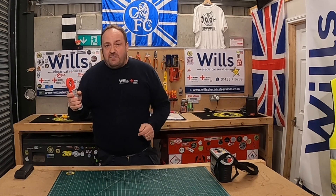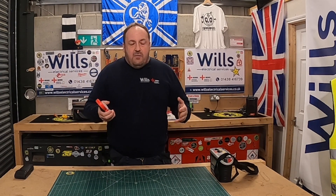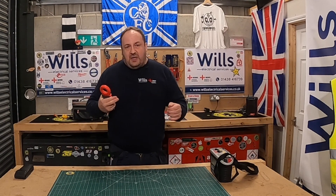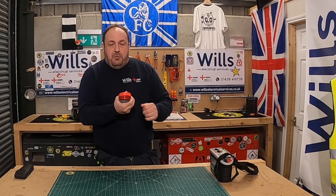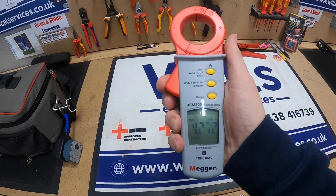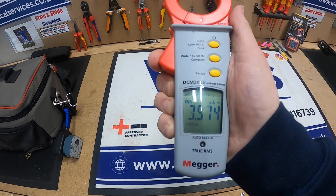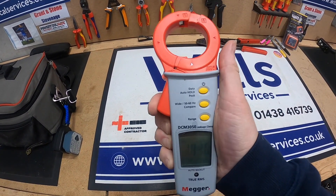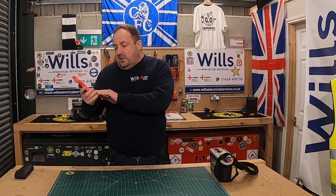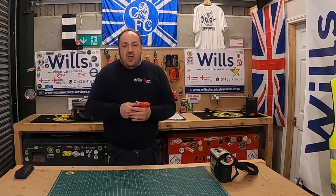Another function — and I've not had a fault since I've had this, and I've actually got two of them now — is that if it's an appliance causing the issue, you can get an extension lead, strip the cable, take the earth out of it, put it through the clamp, and then plug the appliance in. If it is the appliance, the reading bounces up and down noticeably. If it's stagnant, it's just leakage from the wiring.